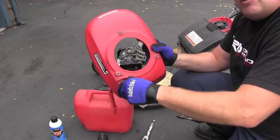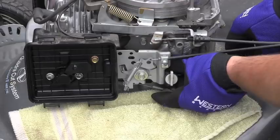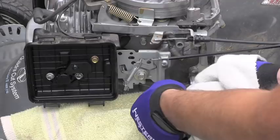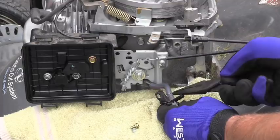The next problem could be within this fuel shut-off valve, and in order to make absolutely sure it will run correctly three weeks later, I need to test it. Using my Phillips screwdriver I will remove the screw holding it attached to this plate — and here we go, the valve is free. I need to keep everything clean, so I will clean it as much as I can. There is the same steel clamp on the line which I have to move backwards to move the line off.